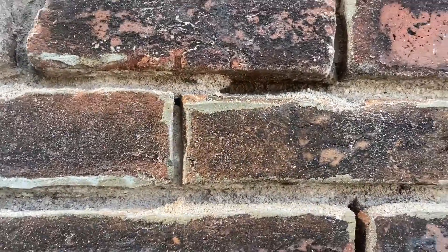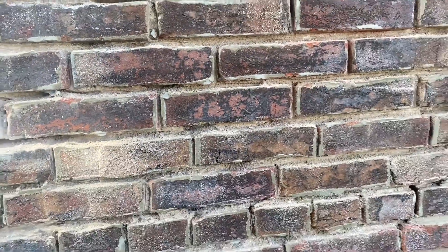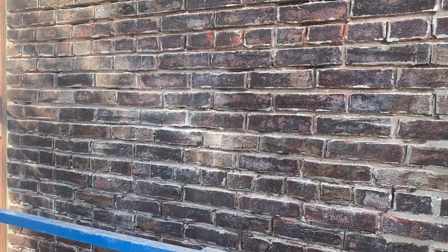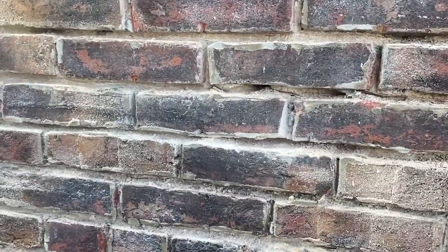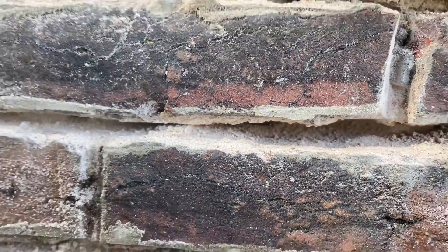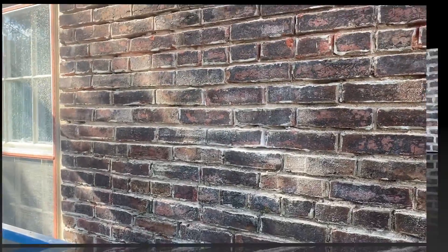There are voids here going back all through the bricks. The reason you use lime on these old brick buildings is because it keeps the vapor permeability in the building and allows the lime mortar to dry out. When it stays wet and freezes repeatedly over years, it starts to fall apart, creating voids that are much deeper and potentially more catastrophic.